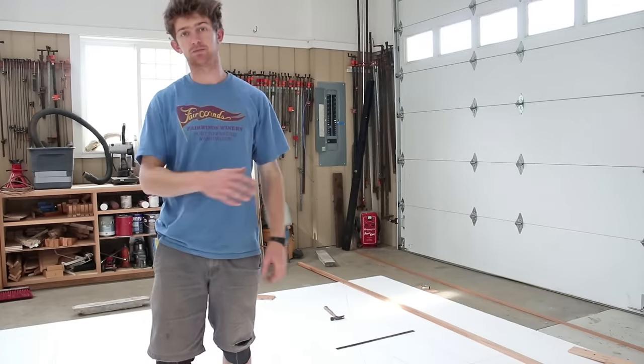So normally on a lines plan you'd have the width in the half breadth plan off the bottom of the keel and the outside of the rabbet, but for some reason Strange didn't put the rabbet in the half breadth plan, so I haven't got any width for the rabbet, I've just got the height of it in the profile view. So I've got away with that up until now, but now I'm going to need the width to complete the water lines which come into the rabbet.